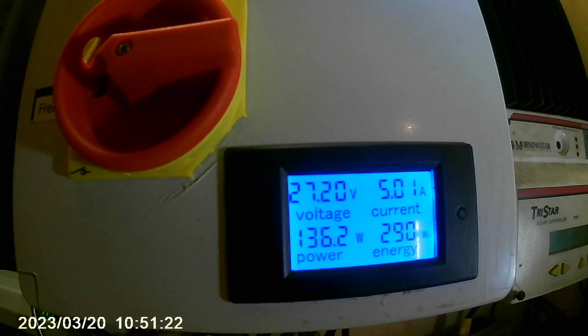My initial goal was 50% rated output. I did see 700 watts. At that point the solar panels were producing just under 100 watts, so it's reasonable to say the turbine created around 600 watts with the solar panels accounting for the other 100 — that's a fair analogy. In 30 km/h winds at my location, I have seen the wind turbine hit above 600 watts — around 700-plus watts. Because it fluctuates quickly, we just monitor as the turbine swings in and out of the wind.